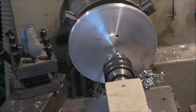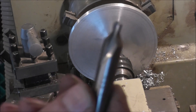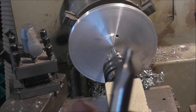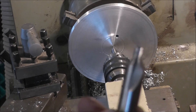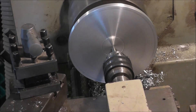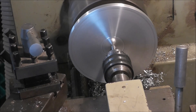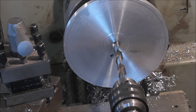The next operation will be to drill a special hole in the center using what we call a center drill, and that will locate the exact center. If you use just a straight drill to start without one — you might call it a center punch mark — the drill will wander off center. You can see the size I want to enlarge it to with that little ring, but I can't do that all at once, so I'll start out with a smaller drill.